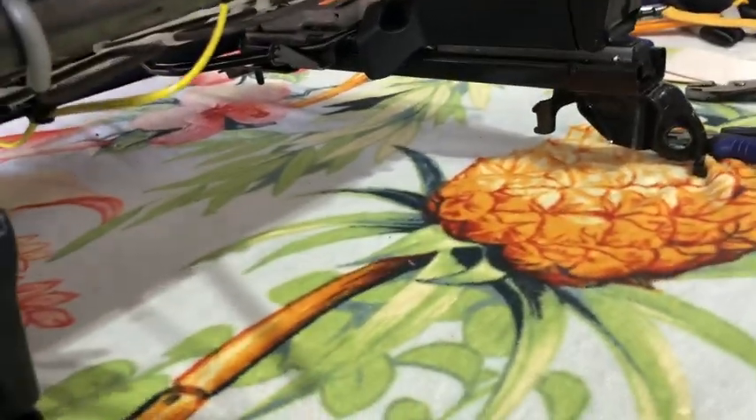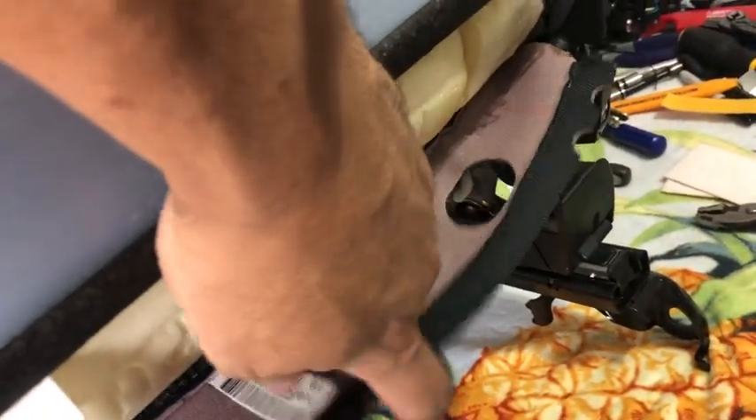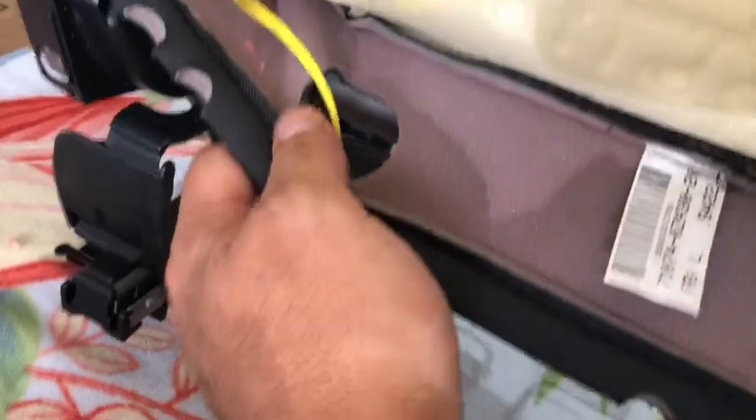Right here you have these wire locks. What I did is I flattened one of the sides so I can go ahead and grab this one right here, pull it, and lose all those hoops, then just put it back in there. Once I remove the wire, I can pull the cover from the front and then install the heater back. To remove the back, I have to run this wire — I don't want to disconnect it for the airbag — so I'm going to remove it from here. There's a block right there, so I'm going to release all these locks and run the back.